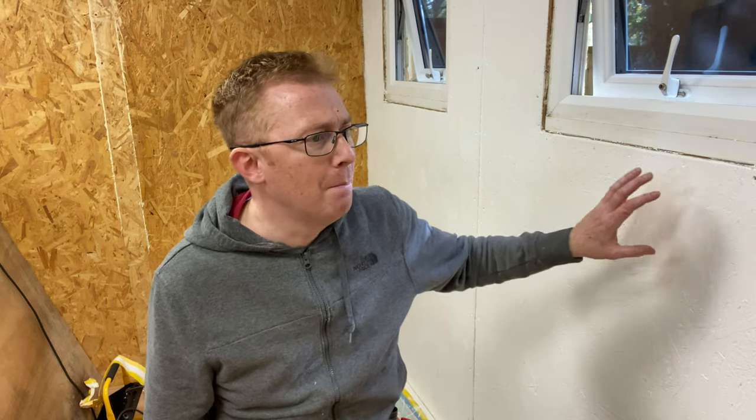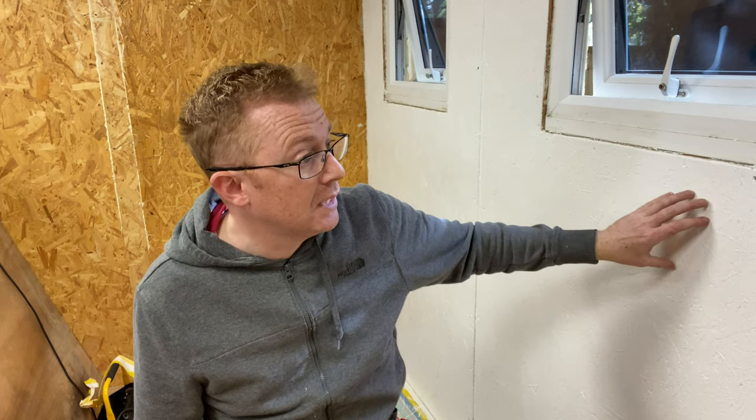Okay, it ended up being a complete second coat as opposed to a little bit of patchwork, but much happier with it now. That Zinsser BIN stuff really is living up to its reputation. Good stuff, a little bit expensive, but I think you get what you pay for with that stuff. So anyway, we're getting prepped, ready for the top coat now, and it's going to be two coats of this.